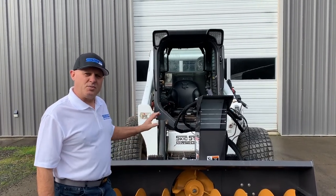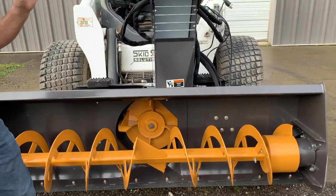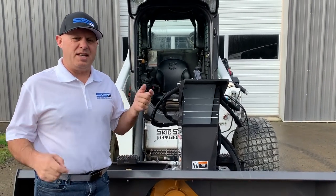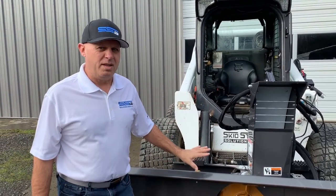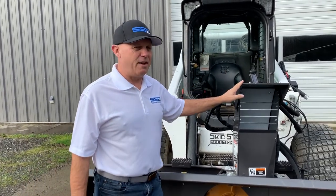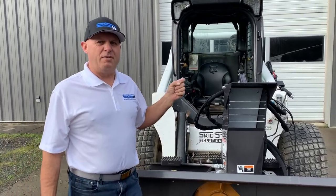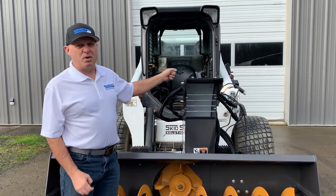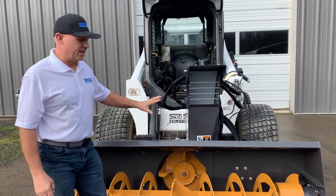It's really important that you've got this spinning in the right direction. Most machines are set up so that when you apply hydraulic force with the trigger switch or the locking detent switch, it's only going to go in one direction. On a low flow machine it's not quite as important if you're able to lock in either direction. However, if you're trying to run a high flow version, it's not going to work properly — when you run it in reverse you don't get high flow. All your lights come on and everything shows you that you have high flow, but you're actually not getting high flow out the couplers because of the way the blocks are situated inside the machines.